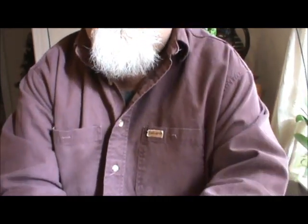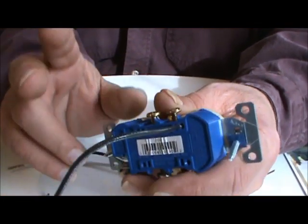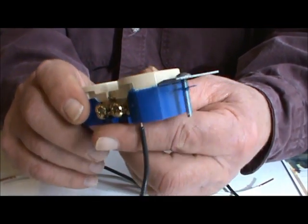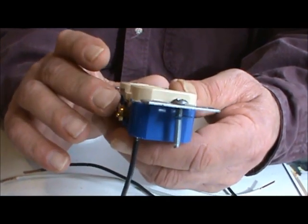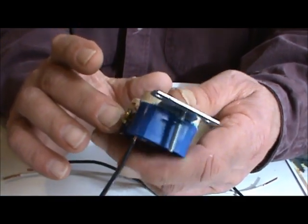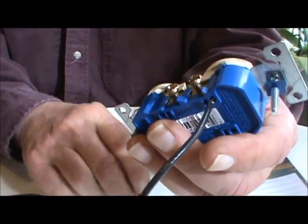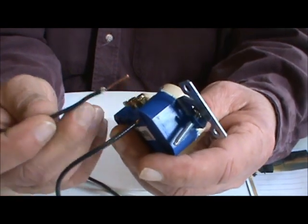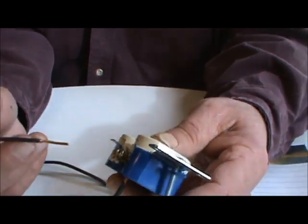If you've got a heater going or a window air conditioner, those are the two culprits that do the most damage because they run for so long — they would just continue running for over three hours — and these will start warming up. You'll have one wire coming in here, and they loop together and go from one receptacle to the next. So all your current is going through that little piece of wire, and every bit of your load from every receptacle on down the line is pulling that same load right through this.